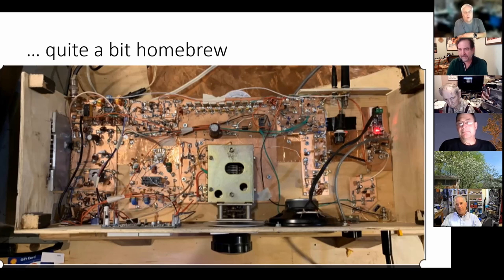We also have an amplifier, a transistor, a 3904 or a 6, in front of that. So I've often wondered if we couldn't just remove that and just use the 386 by itself. Yeah, I think a lot of times people like the transistor before it because it kind of reduces the noise. You usually see an LM386 or another op amp with a single discrete transistor ahead of it. True, I think that establishes the noise parameters there. And again, you're feeding the output of the mixer, so you maybe don't want to put the mixer directly into the high impedance. Yeah, that's probably another reason.